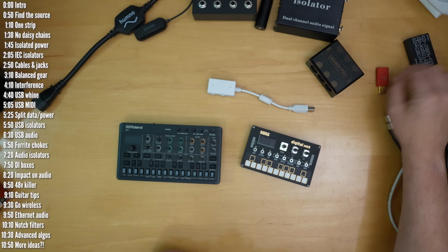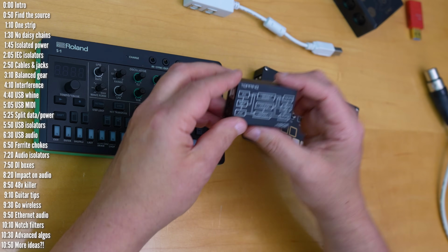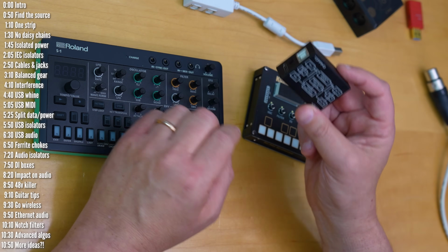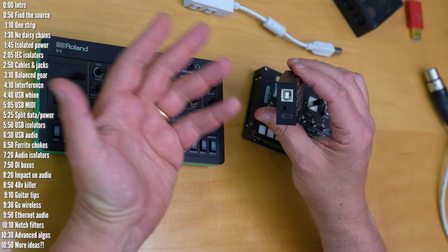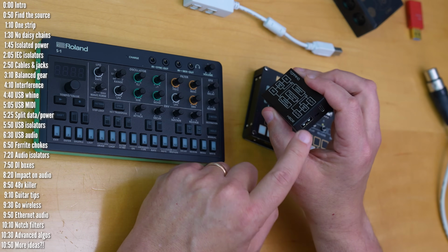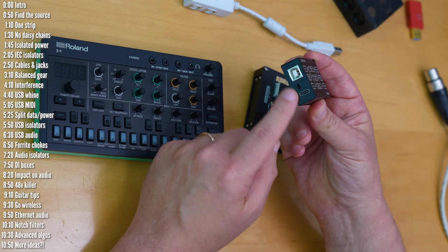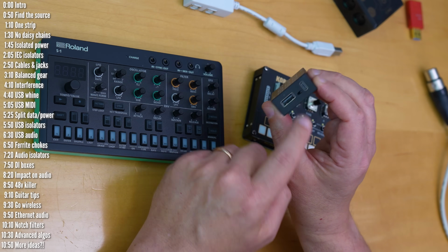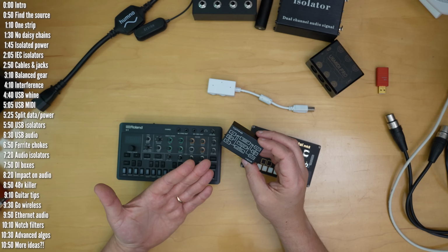And there's a better yet more expensive solution, which is this little guy. If you've got a budget to spend on amenities, the Topping HS02 has become a favorite for two reasons. First, it solves the USB noise problems that I've had without requiring a separate power adapter. You just connect it to your computer on one end and to your device on the other. And then second, because it lets you select either USB type using this switch on both ends. So this saves a bit of time hunting down the right cables. It is, however, relatively speaking, expensive.